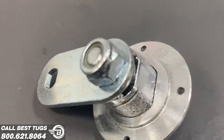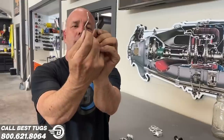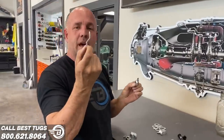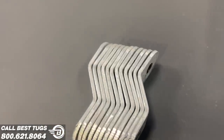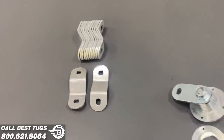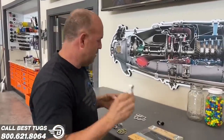And the ordered units and my own made ones, even though mine are bigger to get the offset I need, they're much less weight, and I use a hardened aluminum so it doesn't bend very easy. That was a very difficult bend, but you can see how well they all turned out. Very symmetrical with punched holes in the end. I don't know if you can see that they are squared off so things can't rotate.